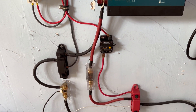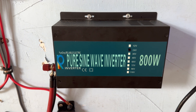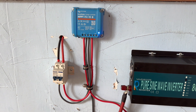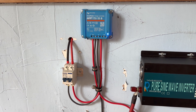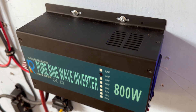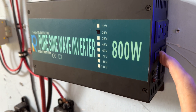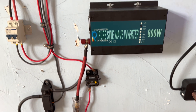This morning however I heard an audible pop and the inverter made a chirp like it does and then stopped working. I went and looked — it didn't throw any breakers, no fuses, everything's working fine. It's still charging the battery — 300 watts of solar outside going through that 7515 smart solar charge controller from Victron, no problems whatsoever. But as I'll show you, that inverter is dead. I'm assuming, since everything looks okay and all breakers and fuses are intact, it must have popped a fuse inside the inverter.